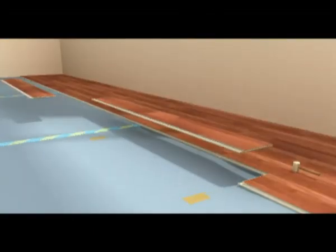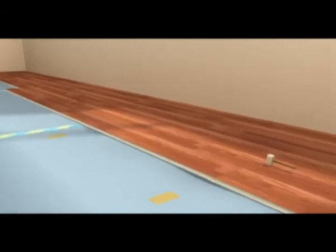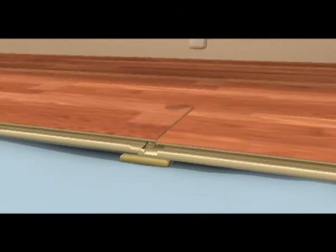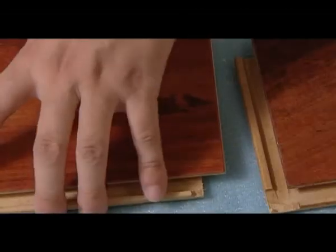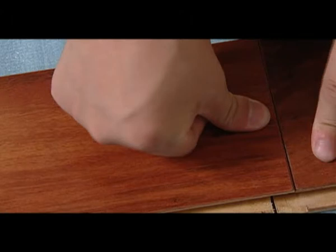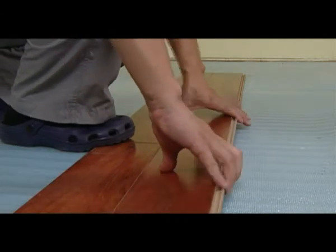4. If two panels are not in the same level, please put a piece of 2 mm plywood under the joint area or spray the concrete floor to be smooth. While tapping the short edge joint area, we strongly recommend that you use your hand or finger to press the exposed edges of the positioned panels so that the panels are in full touch with the ground. If the underfloor is extremely uneven, first use finger to press the low hook of panel 2, then tap the joint area.